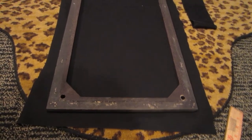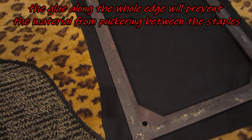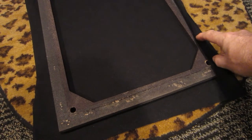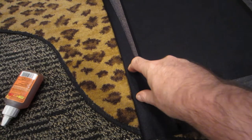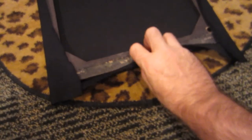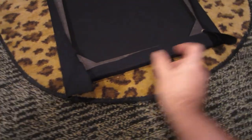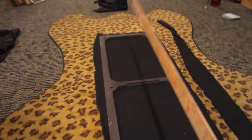To do a stretch pattern, first take a little bit of glue and put it about three inches in from each end. Then take this side and fold it over nice and taut and staple it for about three inches. Come over to the other side, pull it nice and tight, and staple it for three inches. What we're trying to create is a stretch across here so when we fold this one over — just nice and taut, no extra stretch — it basically will be stretched across and won't want to pucker along here. From there you go to the far end and pull it that way.